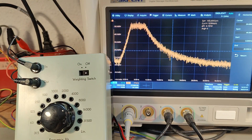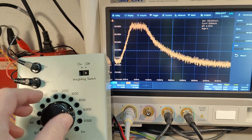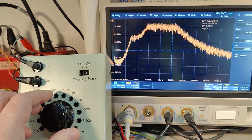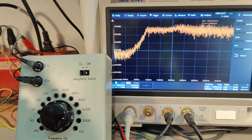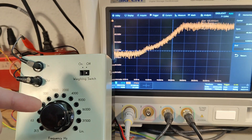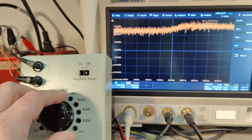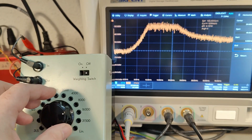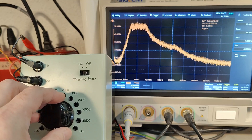So let's try and look a little bit here on my scope. I'm just using the scope as a spectrum analyzer, just for the fun of it — it's just because we can do it in many different ways, but this is just one way. Here is the 8 kHz range. I'm going to take the next one, and I'm using ranged mode so we can see a little bit of the previous when I'm changing the ranges. And that is of course the highest. Then the linear mode — it should be flat all the way. Can you imagine in 1966 using this as a manual frequency analyzer?